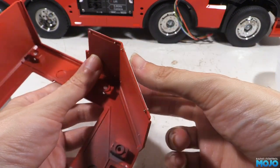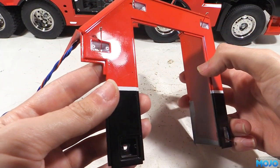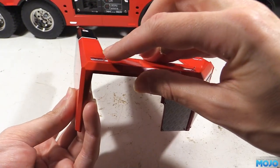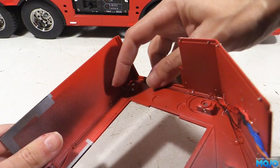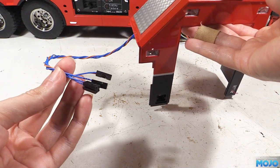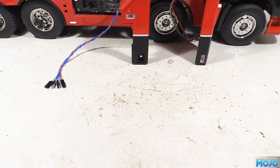First, let's look at the LED install. From the outside, you can see the little LEDs on the wires poking out through all the holes. There's a fair bit of extra wire, so we can position them when the screws are in. On the inside, we can see the wires running around the outside, where they're soldered to some larger wires that run along the chassis and connect to the LED driver. The LEDs are wired as a common anode array, which means all the anodes are connected together and go to the red wire, and the cathodes are separate, with each one having its own blue wire. The wiring on all the other sections is exactly the same, just with a different LED layout.